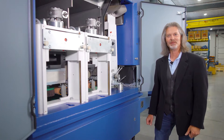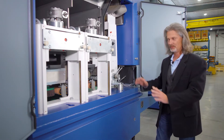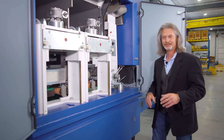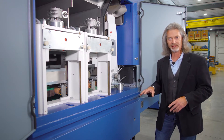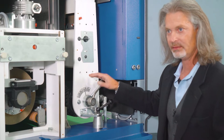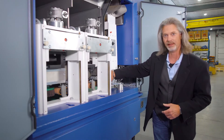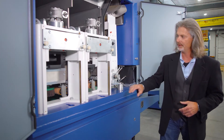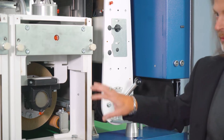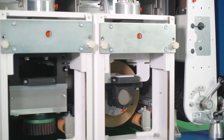The Lismac SMW 5 Series is a modular design, which means we can have two, three, or four heads. This particular machine has three heads. Here we have an abrasive belt — a wide abrasive belt on a rubberized spirally grooved contact drum. In this head we have a barrel brush and in this head we have a top brush.